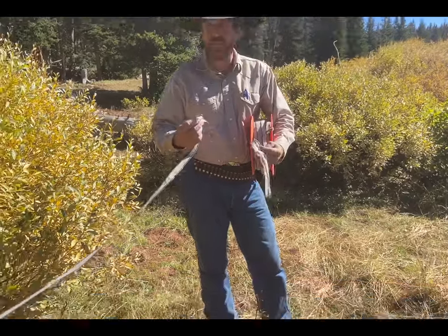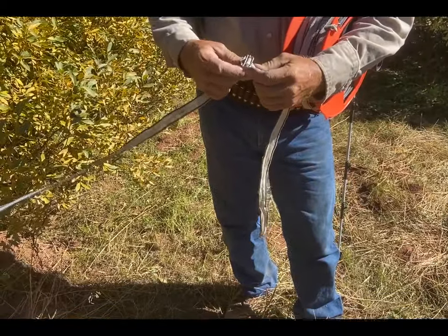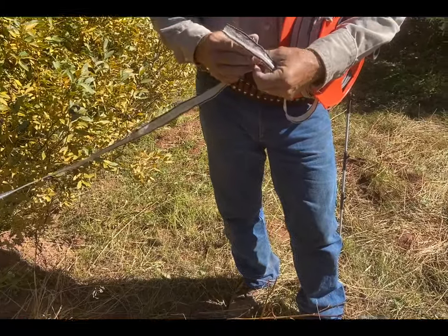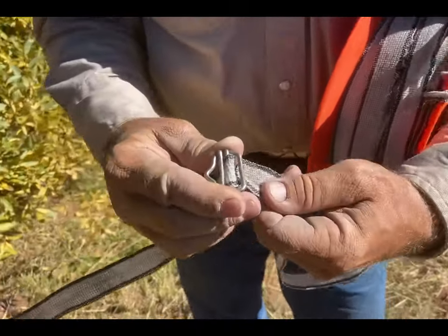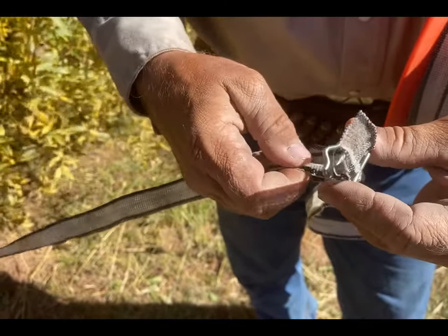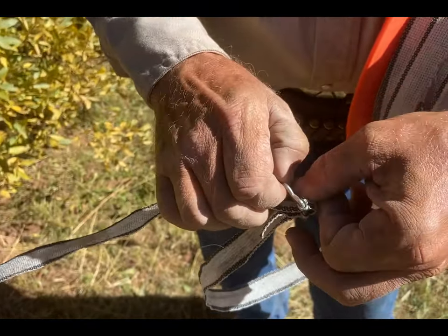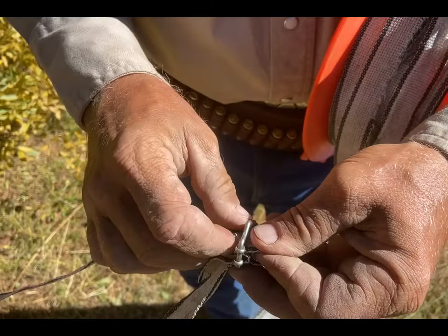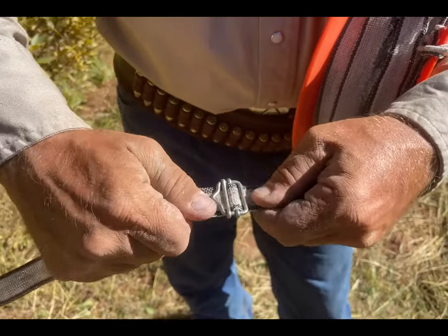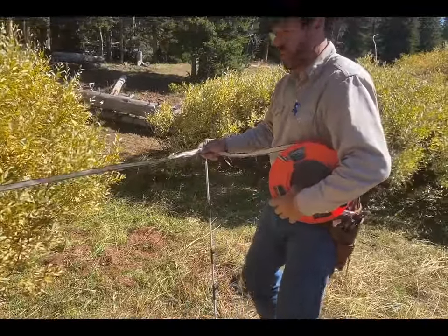Okay, if you have a split, because last time you had to cut it because you wanted a shorter corral or something, inside the stores you can get this instead of tying a knot, so it stays flatter. Tractor Supply carries this, and hardware stores carry this with the electric supplies. But all you're going to do is splice one end and just retrace over top the other one, and pull it through. And now you have a metal bar touching so you don't lose any electricity. I just wanted to show you that real quick.